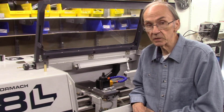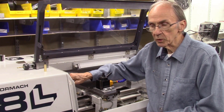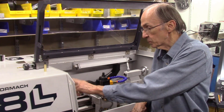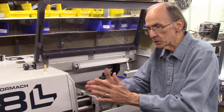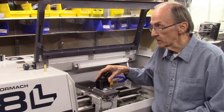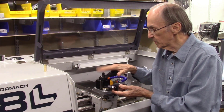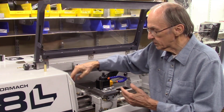Of course the 15L is more costly. I had one minor issue with the system — the collet that holds my brass piece. One or two pieces actually slipped because I didn't have the chuck tight enough. But once it was tightened up enough, I had no further issues. It needs to be quite tight to hold the pieces, as I was getting slippage while drilling — the pressure of the drill going in caused the piece to slide very slightly. I'm glad I changed to the AXA tool post, which I described in a previous video. When I first started this project, I was trying to run it with the OXA tool post and it just wasn't stable enough for these long tool holders holding drill bits. But the AXA worked quite nicely and I got nice drilling cycles and tapping cycles on this piece.